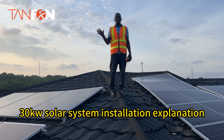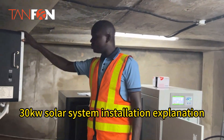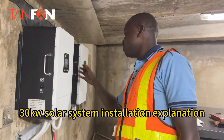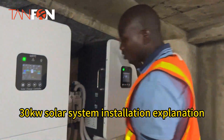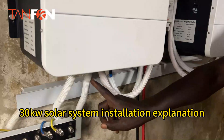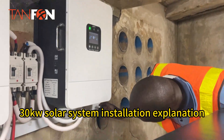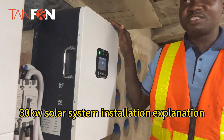At the end of the day, we have a combiner that sums up all three individual strings. In today's video, we are going to explain how to connect the system. This is the MPPT — solar maximum power point tracker — rated at 100 amps each. In our installation we have two different circuits connected to the MPPT. Roof 1 is connected to MPPT 1 and Roof 2 is connected to MPPT 2. The solar panel input is connected to the positive and negative terminals, and the battery terminals are connected via a DC breaker for MPPT protection.